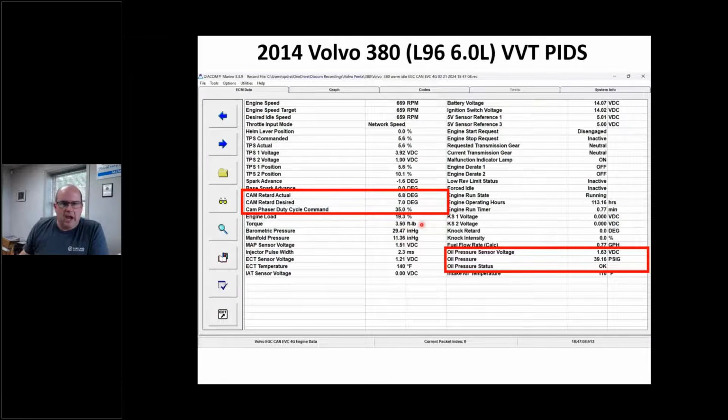And this happens to be a scan tool capture. To my knowledge, these things are always installed at the fully advanced position. Excuse me, they're always running at idle, especially at the fully advanced position. So this thing can advance 7 degrees, and it can retard what, 56 or 57 off the top of my head, but it's got a range of motion of 62.